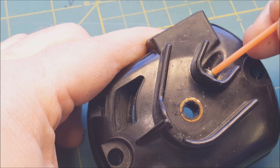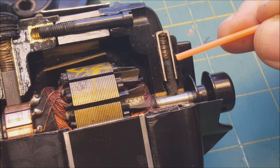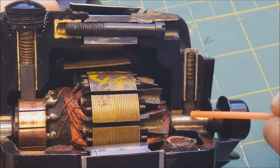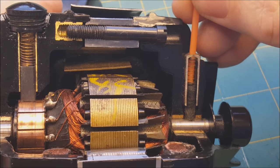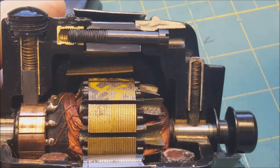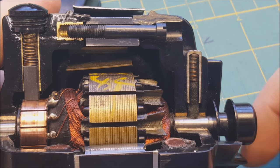This one is only about a half inch from the top of this port all the way down to the shaft. One thing to mention with this motor is we often wonder about over-lubricating or pushing too hard with the lubricant. This port here is a cutaway of a bronze bushing that the felt is going through. If you were to push too hard down on this, there's no place for that felt to go — it's up against the shaft, you can't push it into the motor as some people are afraid of. What you could do is if you took a needle and really forced it in there, you could start to destroy the wick, and that wouldn't be good. But you're not going to push this wick into the motor — it's against the shaft, it can't go anywhere.